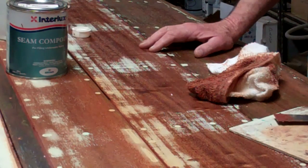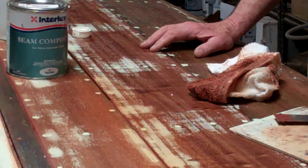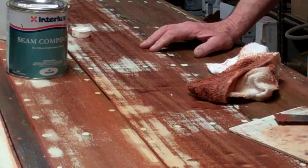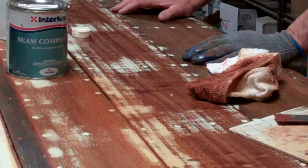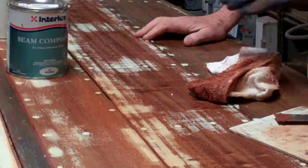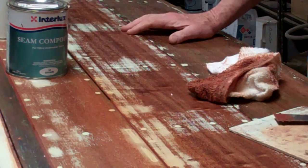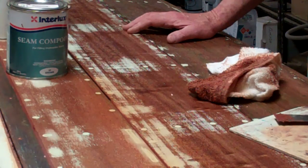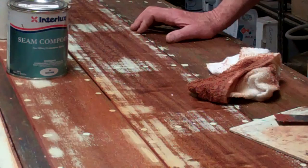It's great to see this bottom fully intact, strong, and almost ready to float. I'll keep working filling seams. John, later today, will be back filling countersinks with their first coat of 3M Premium Marine Filler. Once he's got that all done and has sanded the starboard face of the bottom, we can proceed with sealing, filling the seams, priming, and painting. Her bottom's going to be a beautiful, dark, very rich, very true green. Can't wait to see it. Goodbye for now from Snake Mountain Boat Works.